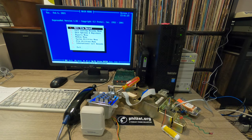So going back to what I was talking about with the Wyse in terms of power consumption, that was also something I was considering for this machine since I'm also running this 24/7. I had the option to get either this machine or an identical one with an Intel i3 processor, and the power usage for the Xeon wasn't much more than the i3. So I believe the Xeon would give me a lot more benefits overall, especially because I can use things like ECC memory in the future if I wanted to.